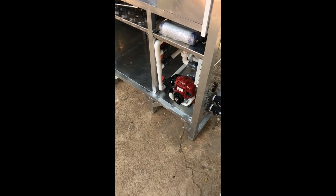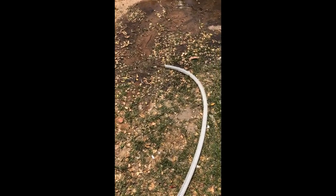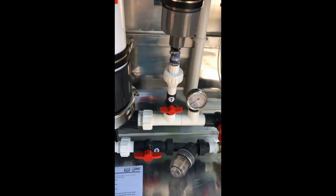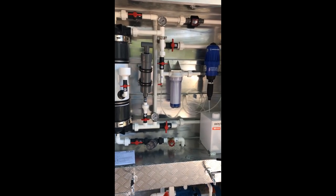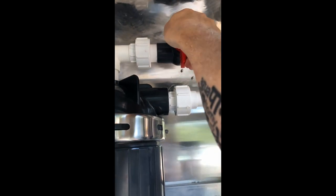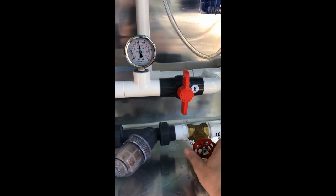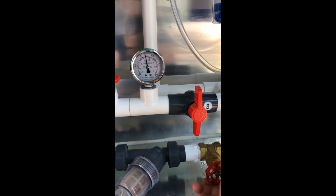We are now operating the petrol pump and flush water is coming out of the flush hose. We run at medium speed and do this rinse for 10 minutes. After 10 minutes of flushing the filter, we open valve 3 and close valve 1, then immediately check the pressure gauge — it will have gone up to about 17 PSI. We then close the gate valve down until the meter reads 10 PSI.